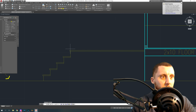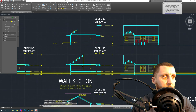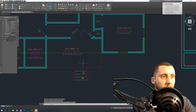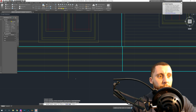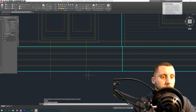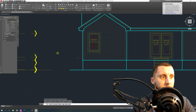I'm going to do copy and grab from this top corner and stick that on all of these top corners. On the floor plan, the width of the stairs is 4 feet and they're centered on the door — 2 feet to the left, 2 feet to the right. So I'm going to draw a line down from the center of the door, offset that by 2 feet left and right, erase the middle line, then do trim — select these two lines and hit Enter. That gets all the yellow ones out. That's where the stairs are going to be.